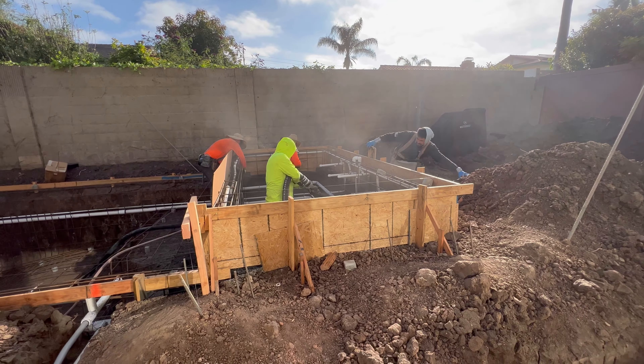These wires come out to set typically the day before they shoot — they're really just guides for the wall thickness. They'll also run lines sometimes for steps, but mainly they run them for the bond beam thickness and the walls. You can see a lower line in the front here for the step, which they ended up lowering a little bit.